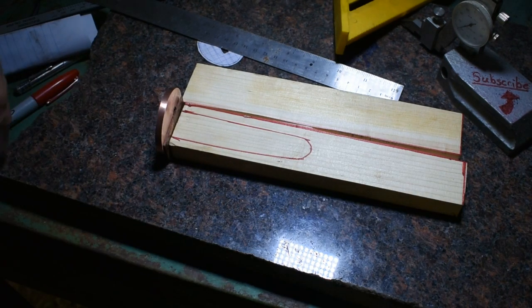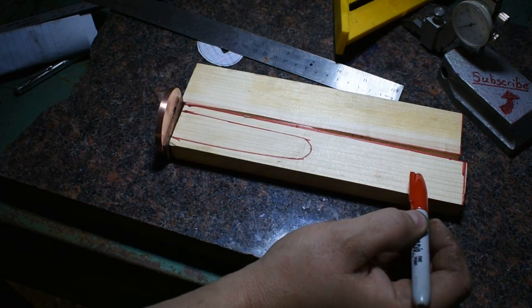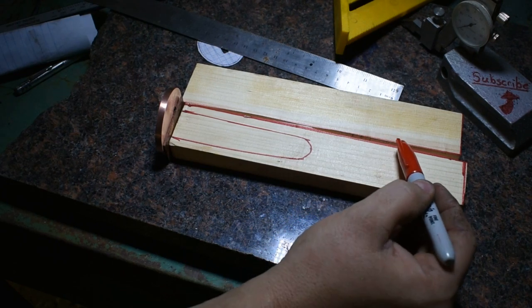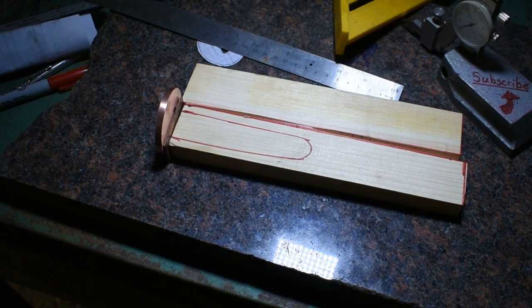But these files are a lot like 1095. I had a lot of extra 1095 laying around, so I'm going to weld an extension on. And so I will extend it out to about 3/4 of the way of the handle here. I feel a whole lot better with that. Alrighty.